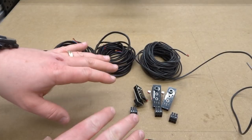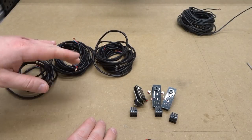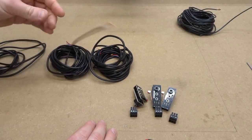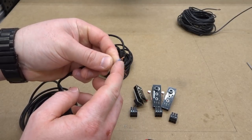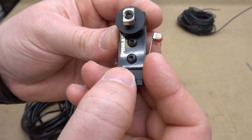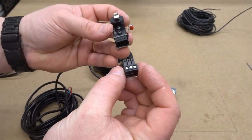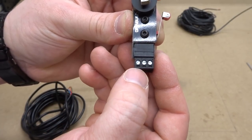Back at the micro limit switches — set the 18-foot cable aside as that goes to our LED light ring. We have three-conductor wire times three. The two at 13 feet go to the Z-axis and X-axis; the seven-foot cable attaches to our Y. Taking one end of the three-conductor wire, correspond it to the connections on the micro limit switch: black for ground, red for power, and blue for signal. The PCB has labels making it easy — ground, positive, and signal, meaning black, red, and blue respectively. Looking at the male pin connector, we need blue to the right, red in the center, black to the left.